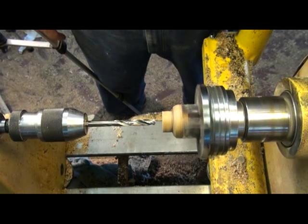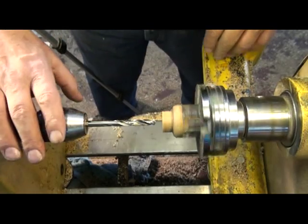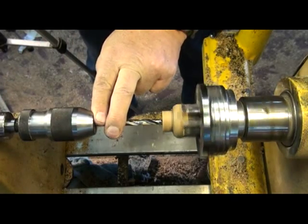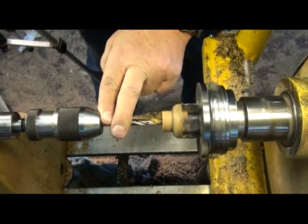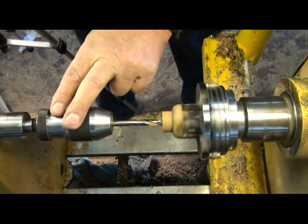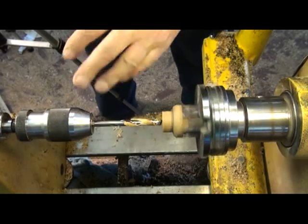When you're doing this, your lathe does not have to be turning really fast. I'm turning about 525 RPM or so. I've got my tailstock locked into place and I'm simply going to advance this drill bit into the wood. Shavings are clearing pretty well — I'm going to back it off just a little bit. I don't really need to go all the way through; I'm deep enough. Now I'm going to get ready for my tap and tap my female threads.